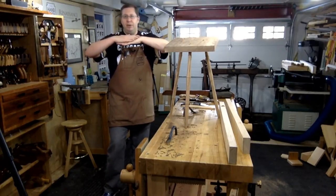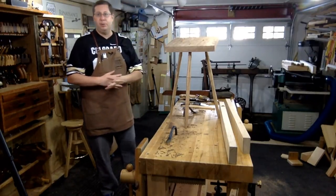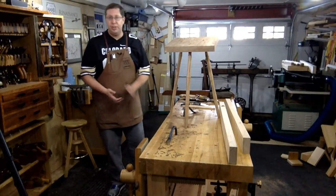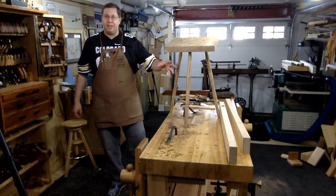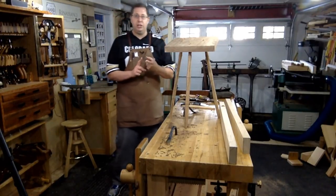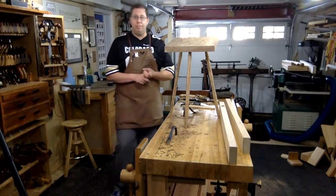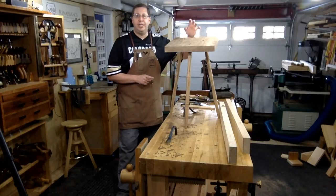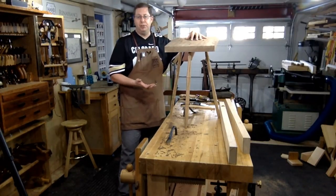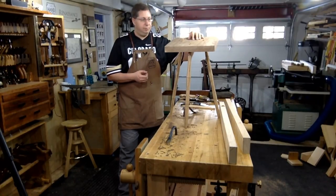It's not to say that if you have the slightest little overlap, it's going to be the end of the world, but you just need to be really careful about that. So traditional Windsor chairs are generally made up of three woods. You've got a dense piece like maple for the legs and any of the turnings, baluster turnings and such. You've got a good steam bending strength wood, usually ring porous, for your bent parts. And you've got a good, easy to carve piece for your seat blank. So pine, red oak, and maple is what you see traditionally. Hickory, white oak could also be put in there.